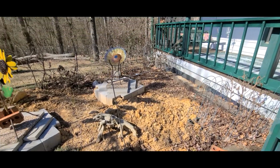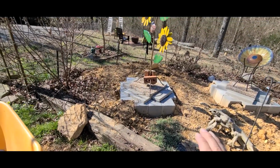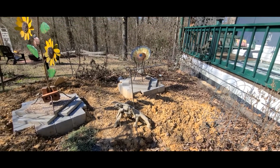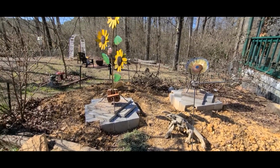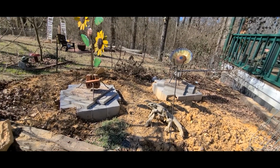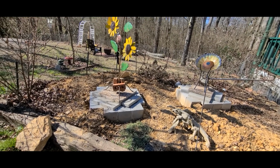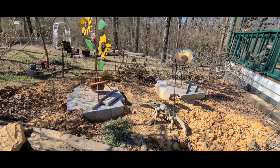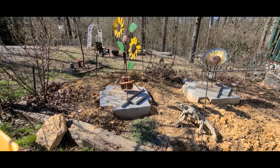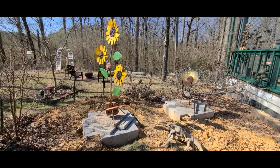We finally had a good dry spell where this clay is dried up, so we're going to backfill the area for our septic tank. We wanted to do this so that it'll give easier access the next time we need it serviced. So we just built the structure around each of the access holes for when they pump it out. You don't have to redig the whole thing back out and try to find it again. Instead of just reburying it and marking it with posts and then wasting time having to redig it five years later, that's normally the recommended service interval, five years.